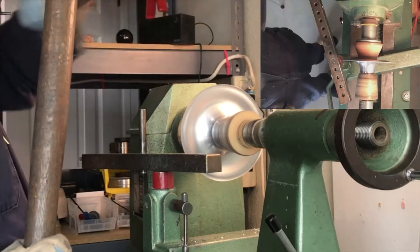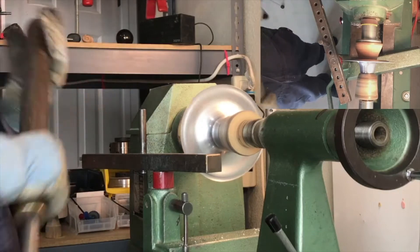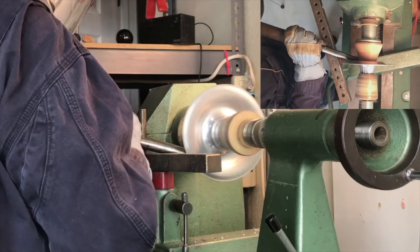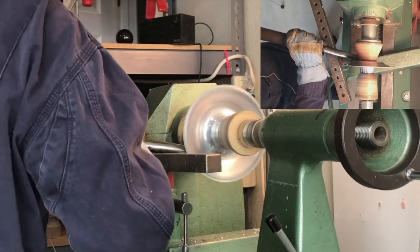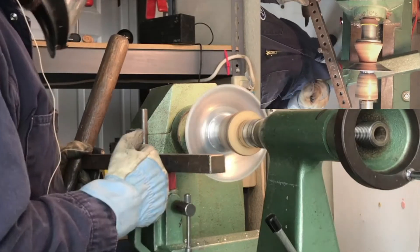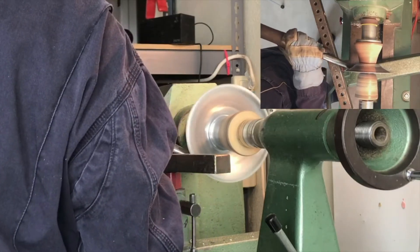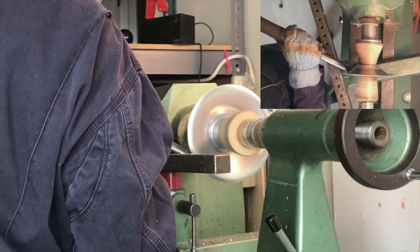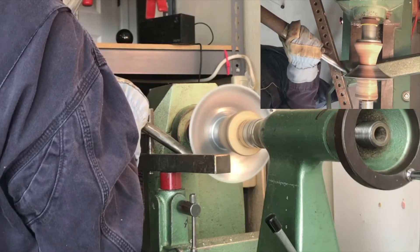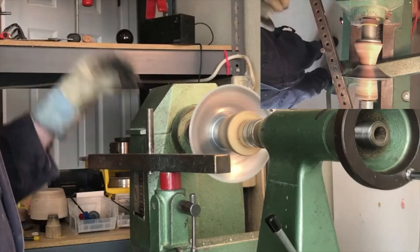You could also design other chucks where you flip the piece and continue to spin against the headstock. In this case, it's easy enough to just spin against the tailstock as long as this is locked down well. A lot of people when they're getting started ask about the placement of the tool rest and post — there's certainly a lot of experience and art to that decision making. You can see the metal kind of coming back off the chuck a little bit as I'm working it because of the force I'm exerting on it. You want to make sure this outer rolled edge will be sitting further down than the candle cup so it sits on that rolled edge on a table.